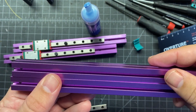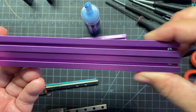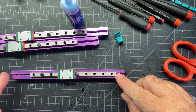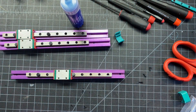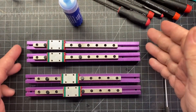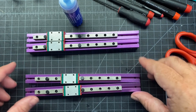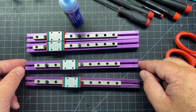For the Z-axis you're going to need the C extrusion, which is a little different — it has holes on both ends. With the Z extrusion you only want about 33 millimeters instead of the 38 millimeters like you did on the Y rails. At this point I've got the two Y extrusions with 38 millimeters and the hole, and the two Z extrusions with 33 millimeters from the edge.